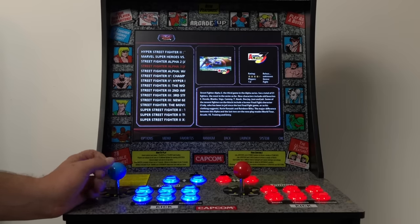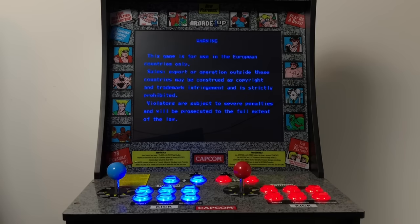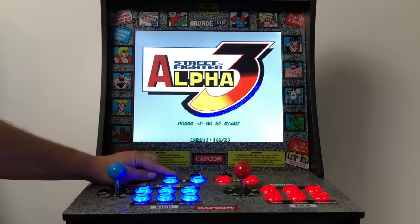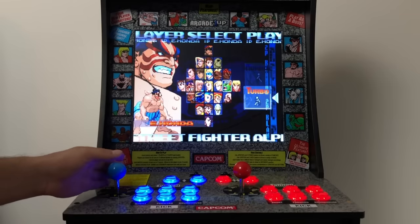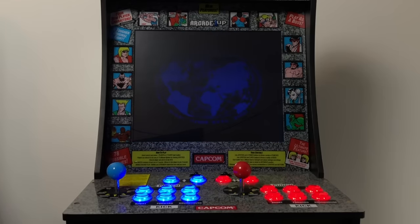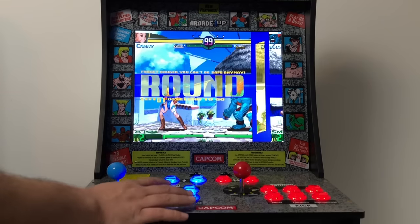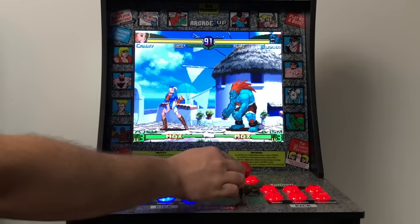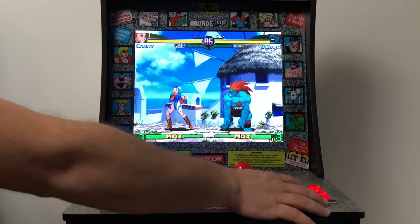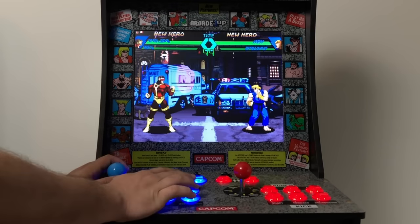Now it's time to test all the controls. Make sure you bolt your control panel back down and check everything is right before putting screws in, because you may have to rewire. Since this is a Street Fighter cab, we're going to go with a Street Fighter game. I'll put some coins in for the first player by pressing select, press start — got the first player up. Throw in coins for the second player. Both encoders are working independently and not interfering with each other — got a two-player control panel working. Testing X-Men versus Street Fighter as well and it's working fine.